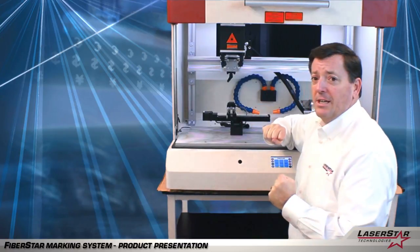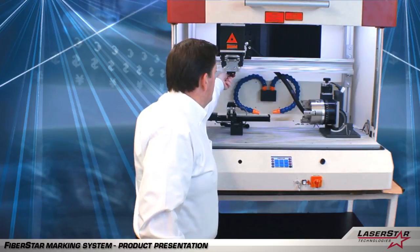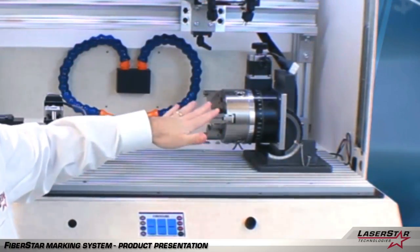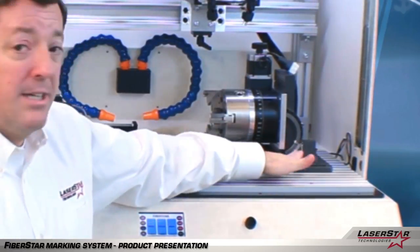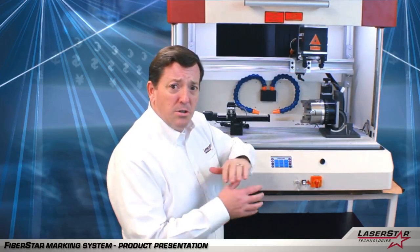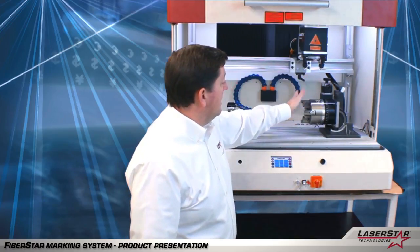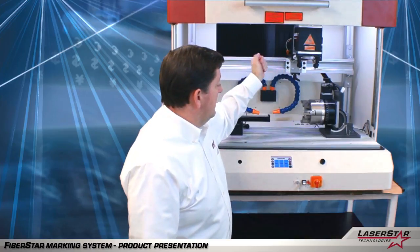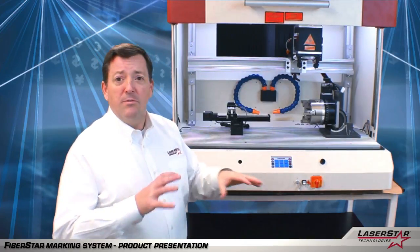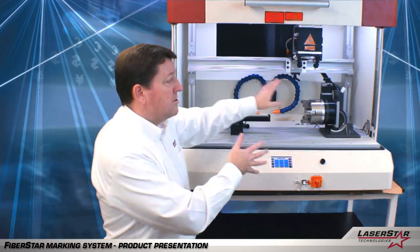Let's say you did a variety of parts in the morning and now you have a rotary application in the afternoon. You have the ability to move your eight-stage scanner head assembly to this side, where we have a very large industrial rotary chuck device. It gives you the ability to set it at multiple index points with fine adjustment of the chuck itself. If you have a rotary marking application on a cylinder, the scanner head can be pre-positioned with a positive stop to work on that particular job and lock it in place. Clients who have multiple fixturing setups appreciate being able to stage two setups and just move the scanner head, saving 10 to 20 minutes of teardown time.